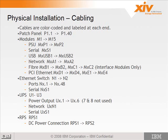Yeah. It implied like you had to replace. There's nothing in that. Yeah, I guess I didn't mention, that's an exception also, the power supplies. So the only FRUs that you can replace in a module are the drives or the power supplies. That's it. Nothing that's under the cover. It requires you to pull the cover off.